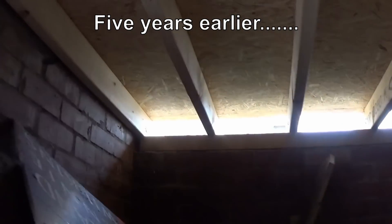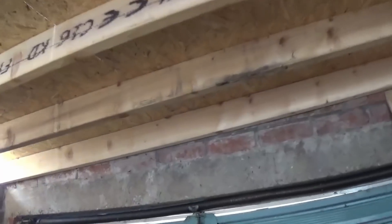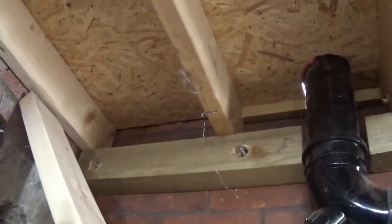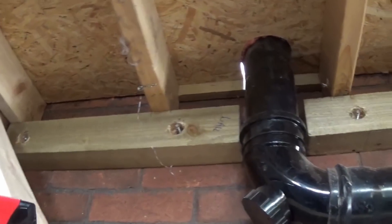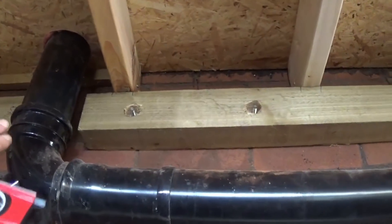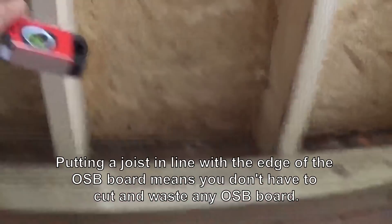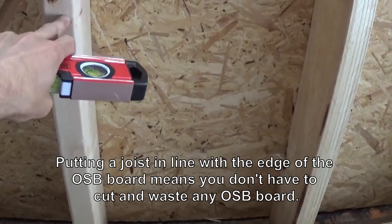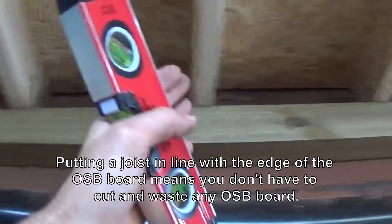Inside the garage I just want to show you all the joists. With this we used OSB board and the size of that was four by eight foot. You need to work out the distance between your joists and ideally you want them about 40 centimetres. That adds a bit of strength. You also want the end line of your board to meet the centre of these joists, so where the next one comes in you're able to screw both into the same joist, and then work out an even spacing in between all your joists.